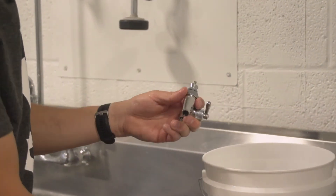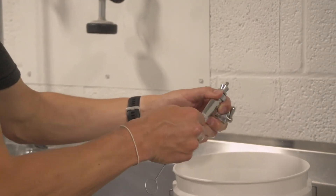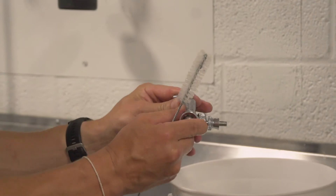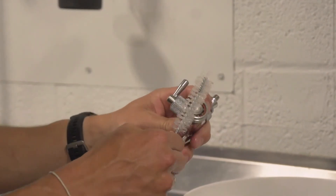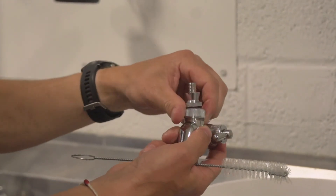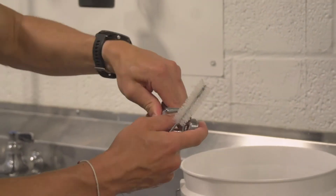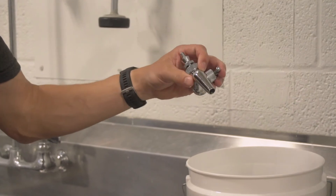Once your faucet has been soaking for a while, use your brush. Make sure to clean the inside of the faucet, around all the spots, the hard to get spots. Put the flow control down to get in there, then put the flow control up to get behind it. You can also take off the entire flow control lever and the top part as well, disassemble and make sure that all the O-rings inside are good and that the faucet is in top working condition.